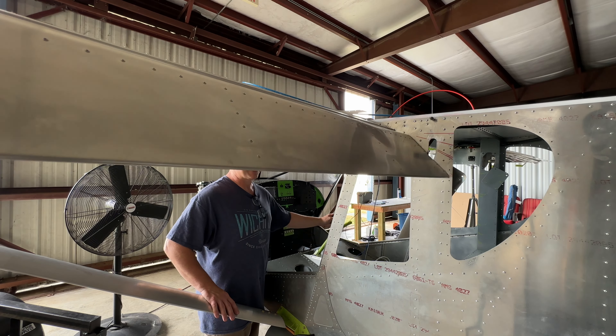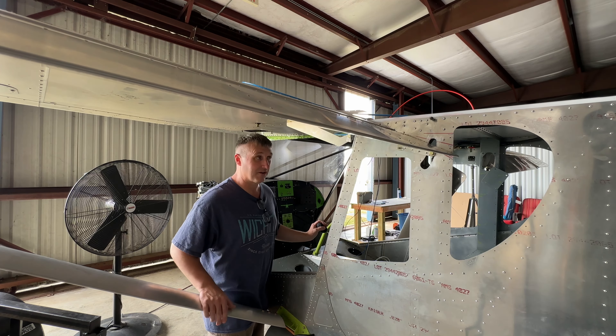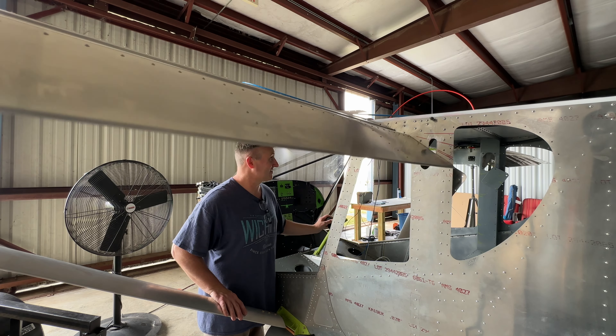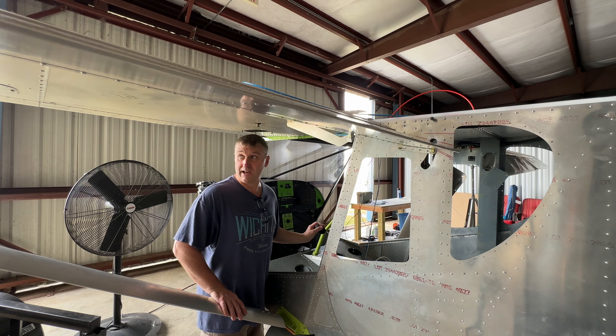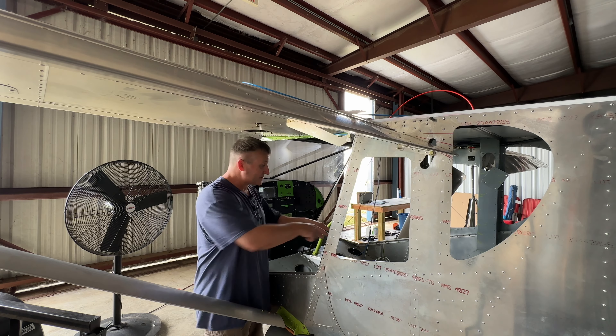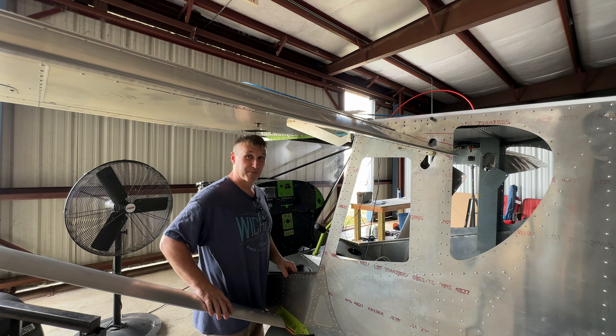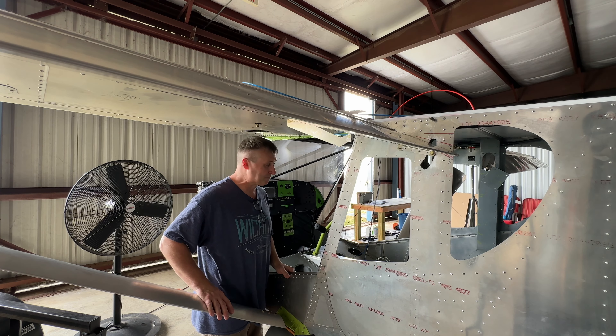Flaps are all the way down again — this is beyond 15 degrees anyway, so I might try to find a way to restrict it. I don't think the resistance is gonna be a problem. The only thing now is to adjust the stops for the flaperon inside the airplane, and that might present a little challenge in itself — we'll see.